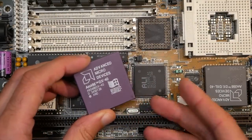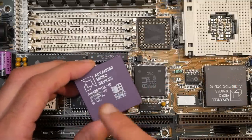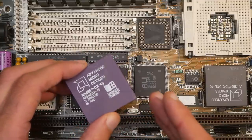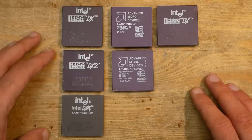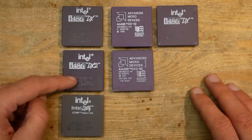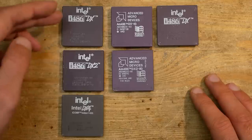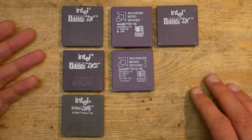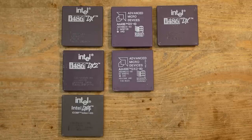So what's the difference between a 386 and a 486 CPU regarding clock? A 486 is directly supplied with external clock, which also defines the frontside bus. For example, a 486 DX25 is clocked at 25 MHz; a DX33 and DX40 are clocked at 33 and 40 MHz respectively. The 486 DX2 CPUs double the applied clock internally, and DX4 CPUs triple it. So a 486 DX33, 486 DX2 66, and 486 DX4 100 all work with 33 MHz external clock and multiply it internally by one, two, or three.